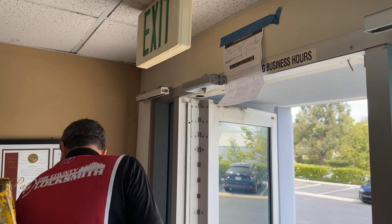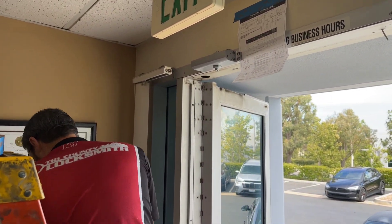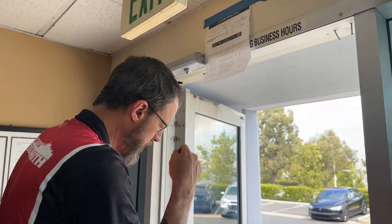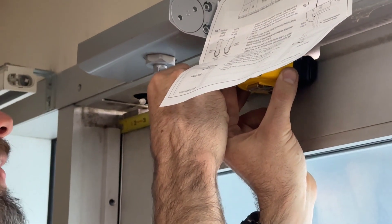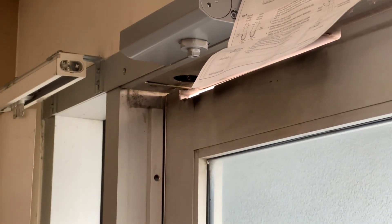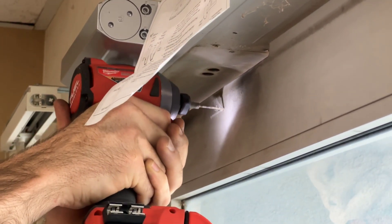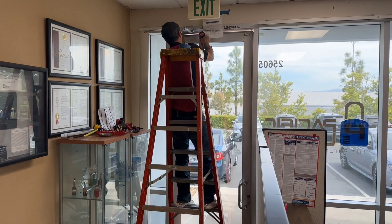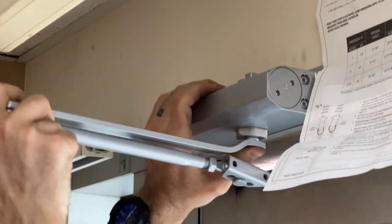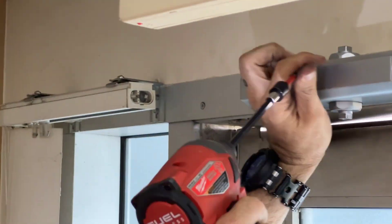We have an impact driver and the external mounted closer that's going to go right into those holes, measured according to the specifications of this particular product. Make sure it's mounted in the correct direction, tighten everything down, and mount the body of the door closer itself into the top of the frame. Then we take measurements per the manufacturer's instructions and measure out where the arm is going to be located. We're mounting this in the standard format — not parallel mounted. My favorite way to do it is to use a small drill bit like an eighth-inch bit and then use the self-tapping screws after that, which gives you a nice clean hole to start with.